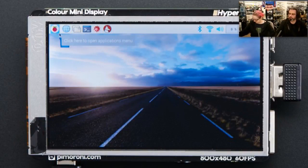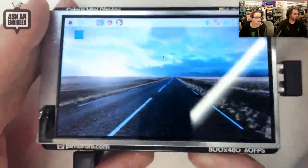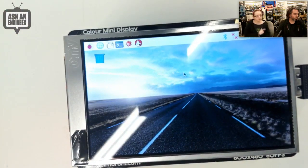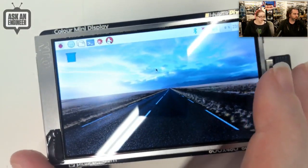I've got the demo over here. It went to sleep, but you have a capacitive touch screen — it's very high-res. It's 800 by 480 and it's IPS, which is a very, very nice screen. Gorgeous! These are used for tablets and phones and stuff. There's one trade-off: it's very fast, high-resolution, and lots of color, but it uses every GPIO pin pretty much.